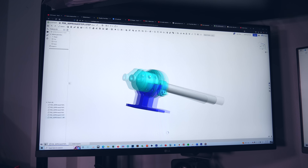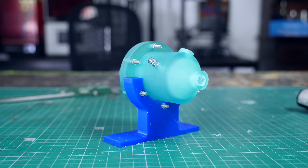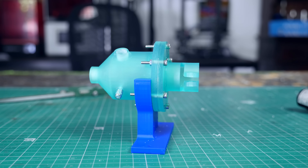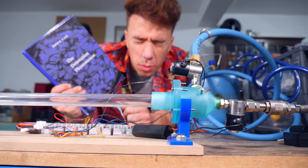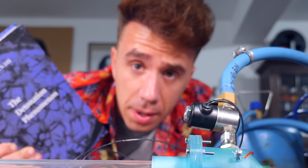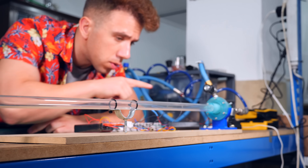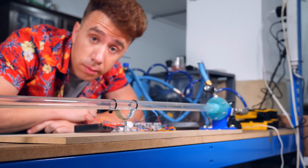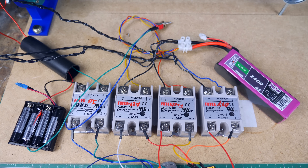Time to design. I 3D printed a small combustion chamber in resin, to which I attached two electro valves — one for the fuel and another for the air. I'm not using oxygen right now because I read that you can get detonation with air and fuel alone. It's really hard to do, but you can. Also, oxygen scares the crap out of me. One of the tricks to get detonation is to use a very long tube — without it, the combustion doesn't have time to accelerate to the speed of sound. That's why I'm using a long acrylic tube, so I can see what's going on. For ignition, I'm using two screws to form a spark gap and a cheap high-voltage generator from Amazon. To control the ignition and the electro valves, I'm using some relays and an Arduino.